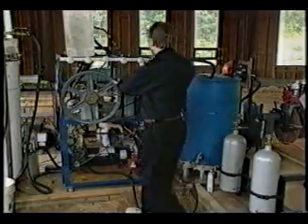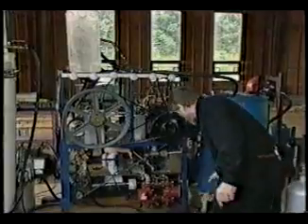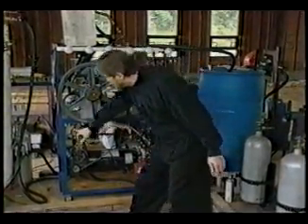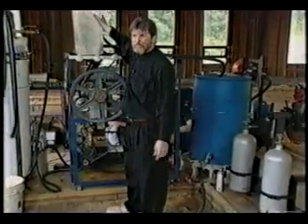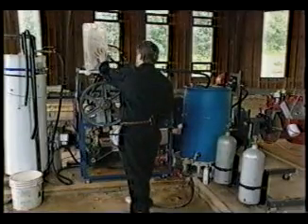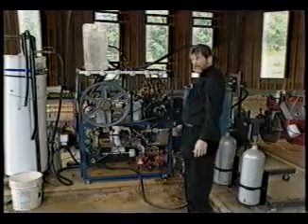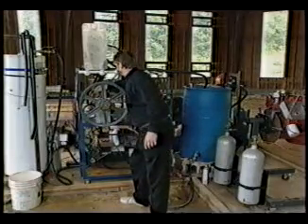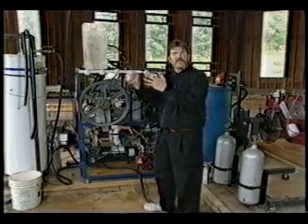Once the freon has taken the heat and made the power, it goes up here to a condenser. We're sucking water out of the bottom of the tank — could be a well — and running the water through this pump, which is also driven by the same drive mechanism, running the water into this condenser. It's the world's most efficient condenser at 100 degree delta T, 6 million BTUs. As we're running the water through, we're making the water hotter. We're also cooling down the freon, which is going into this canister and being pumped right back into the boiler by a little trombone pump running on the same cylinder.